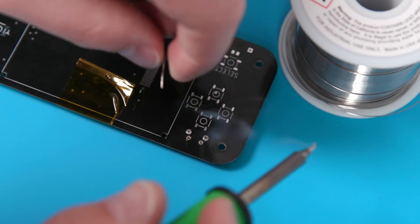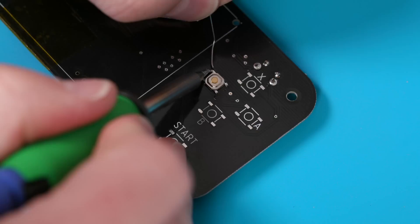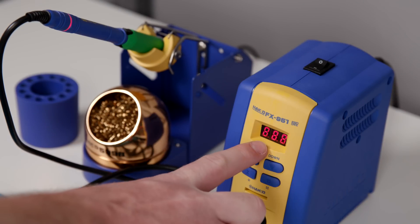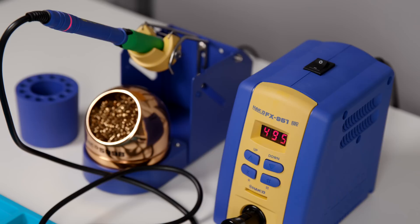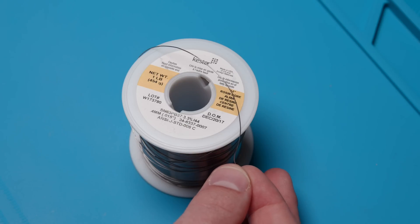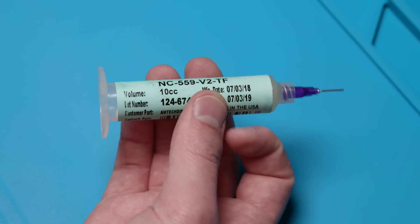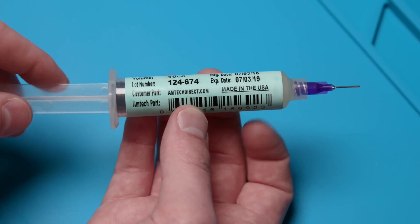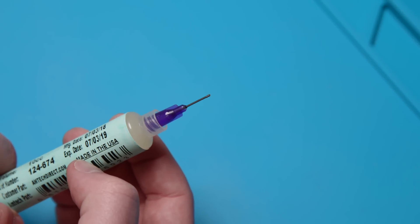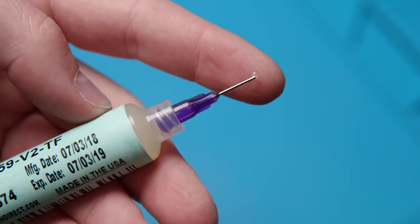Speaking of soldering — I don't really solder. I've done it once or twice before on some big cables, but I'm a total beginner, so if I can do it, then you can do it too. All of the soldering supplies I'm using were recommended by Louis Rossman, including the Hakko 951 soldering station — though a much cheaper $20 soldering iron can do the trick. You'll need some very thin diameter leaded solder — I chose 0.015 inches, brand Kester — and some magical Amtec flux. This stuff is incredible and makes the project significantly easier. Just trust me, buy the flux — if you have rosin flux, throw that away. You want this flux because it is the bomb.